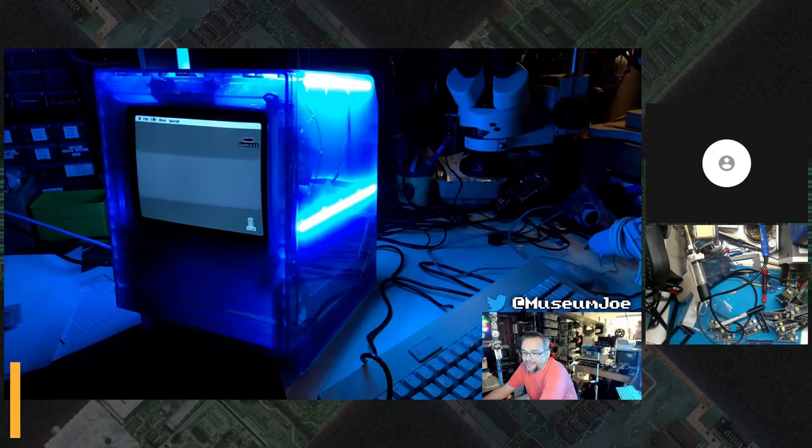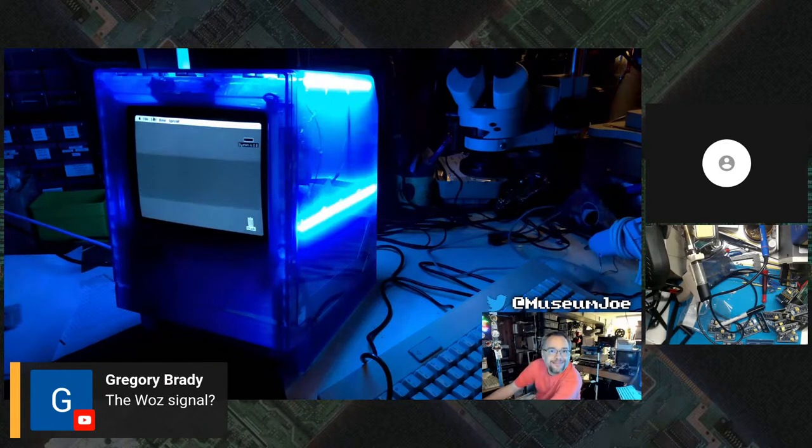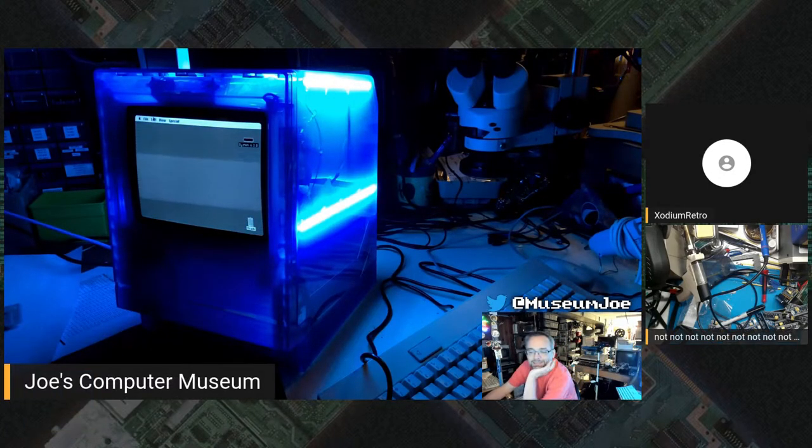It is a very fun build. And don't be like me and totally lose the spare LEDs. Then don't send 5 volts directly to one of the LEDs because that makes it cease to be an LED. It no likey that. I forgot what I did. I think I bent a resistor leg out of the way without actually clipping it and meant to just test it, but didn't think, oh yeah, this is bridging, this is getting the voltage directly. LEDs will pass as much current as you can possibly give them, and if that's more than the current they're supposed to use, they go exploded doodle. They go bad day, bad time.